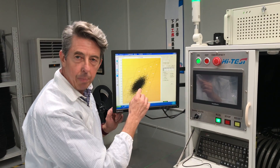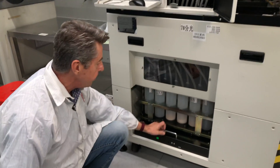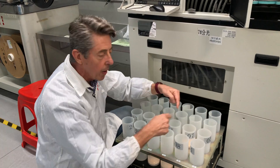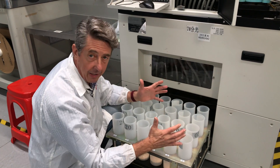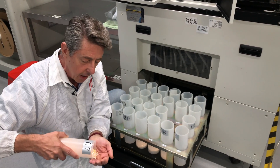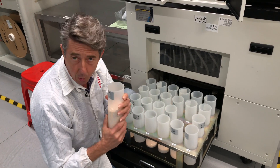This is the chart of all the LEDs being binned right now, and each one of these squares corresponds to a bin in the bottom of the machine. I'm going to stop the machine — this is where it happens. When you talk about binning, this is really what they're referring to. Each one of these bins is a different shade of white. You can make a cheap LED product by using many bins, but you'll have many different shades of white — it's cheaper because you get to use a lot more of the LEDs. When we talk about LED Inspirations being a one-bin company, we're only using one bin for our LEDs. This is all one shade of white without using any of the others. This is what makes a quality product.